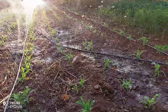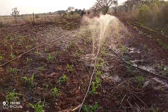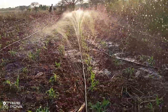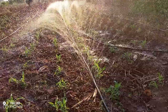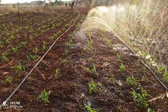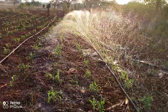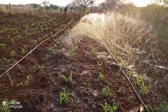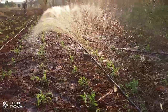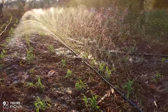From the manufacturer's point of view, the spray radius for the spray pipe is 1.5 meters, meaning it covers a total irrigation diameter of 3 meters. But practically on the ground, this spray pipe can actually spray up to a radius of 3 meters. For example, the two spray pipes are spaced 3 meters apart, but the one currently working has a spray radius of about 2.6 meters, meaning it can effectively irrigate a total diameter of about 5.2 meters.